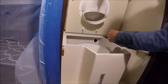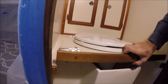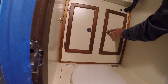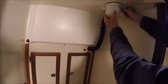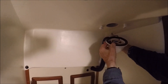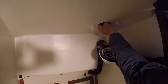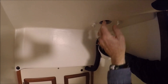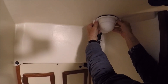The exhaust vent hose comes into the toilet box here, sealed with some caulking, and goes up through the cabinet. There's a switch here for the 12-volt fan, and the hose comes up to where the fan is in this shroud. In heavy weather with seas breaking on deck, you can pull this handle down and close off the deck vent; otherwise it stays open. The fan is a very low power drain.